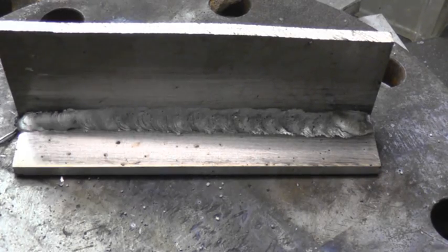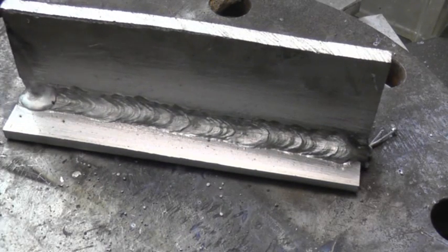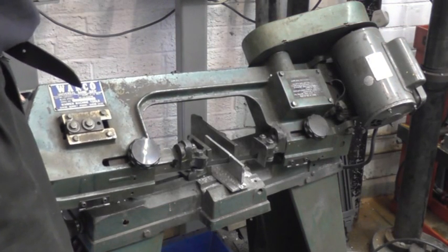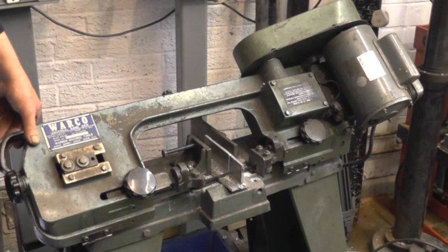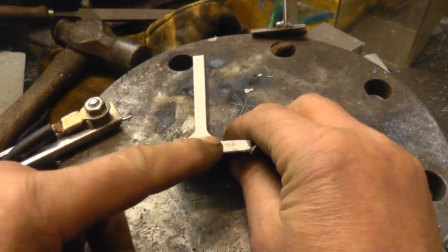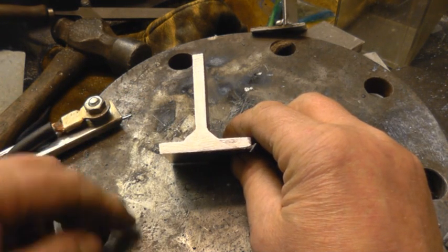That's the T-joint we did on the 6mm plate. We'll weld it that side first and then turn it over and weld the other side. You can see how that side runs in better because it was actually preheated — it was warmer. I'll cut that through on the bandsaw and see what sort of penetration we've achieved. I don't know how well you can see that but it's 100% penetration — that's all one piece of metal now. There's a little bit of undercut on this side of the weld, that's my fault. I'd say it's pretty good.